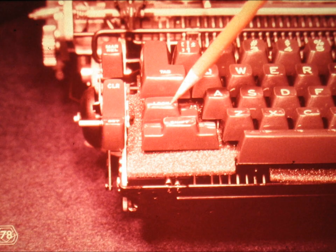Slide 78. Now depress the shift lock key. With the aid of a spring hook, you might squeeze the plastic foam dust cover towards the right between the indicated shift lock key and the tabulation key. This will enable you to see the latch and the keeper which holds the key down. While you're at it, take a moment or two to trace the mechanical connection between the left-hand shift key and the right-hand shift key. Notice that another depression of the shift key on either side of the keyboard releases the shift lock key.